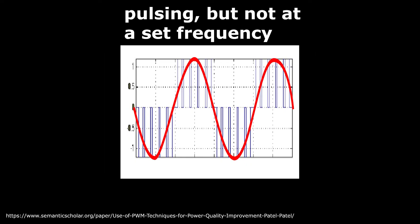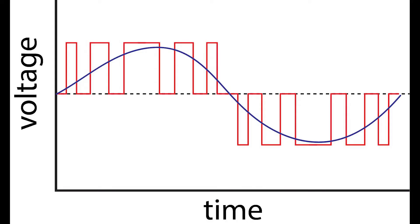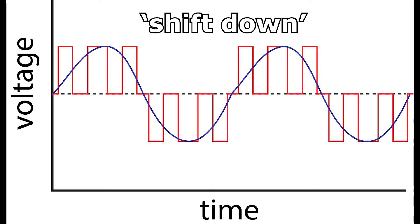But why does the 96 stock make the distinctive gear shift sound? The pattern created by the GTOs had one problem: as the train accelerated, the sine wave would contract, forcing the GTO to turn on and off increasingly fast — faster than they could handle. To solve this, the GTO is programmed to continually simplify the pattern it makes whenever it approaches that limit. This creates the instant tone shift down, or up when decelerating, that we all know and love.